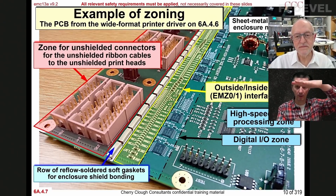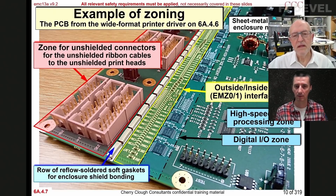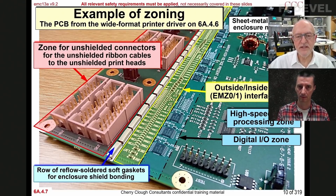So for example, if you have a board and a metal housing, the board should be extremely close to the bottom of the housing? It is better the closer they are. Certainly they should be closer than a tenth of the wavelength at the highest frequency of concern. But the spacing between the bonding points should also be closer than that wavelength.